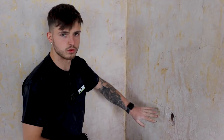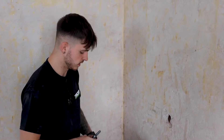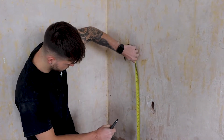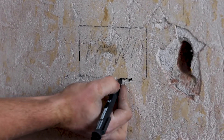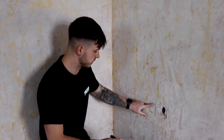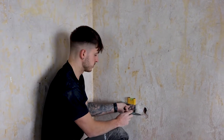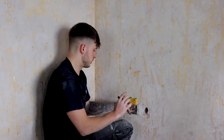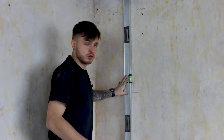So we've got a socket here and I just want to recheck that it's 450 high. I'll get my tape measure and pen — yeah, it's at 450 and 300, so it's at the right height. When you're marking out the boxes you want to make sure you get them bang on, because it'll only cause problems when it's all cut out and you're trying to get the socket level. Spend your time, make sure it's marked out correctly and chased out good. I'm just doing my channel up now.